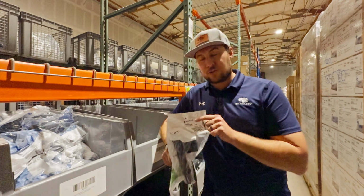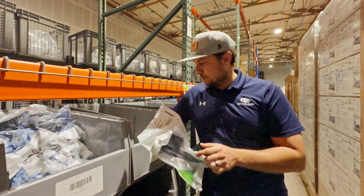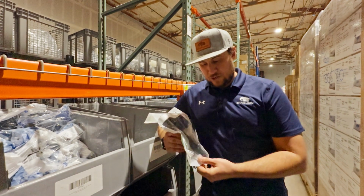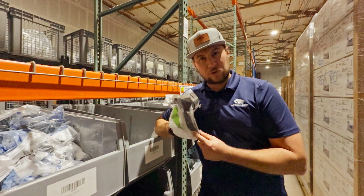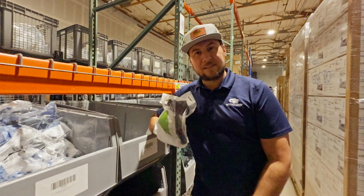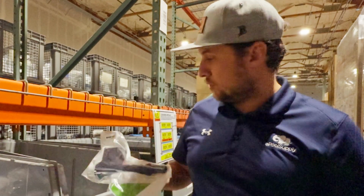So we have these in stock. These are the Pentair OEM brand. 542486 is the part number. We have dozens and dozens of them. They do come with the restrictor seal in there too. What that does is it limits the water flow as well as seals this really, really well inside of the crock. So this is the Pentair water leveler that gets installed in your swimming pool.